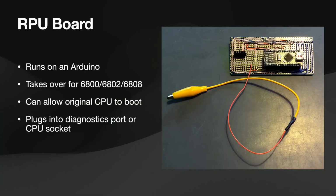So one of the things I put into the early OS was, you could do dim levels on your lamps just by turning them on and off, pulse width modulating them on the interrupt. And that doesn't work great with LEDs, so some people don't implement it that way. But basically, you can imagine that this is like a brand new brain for your machine. So anything you can think of, you can put in there.